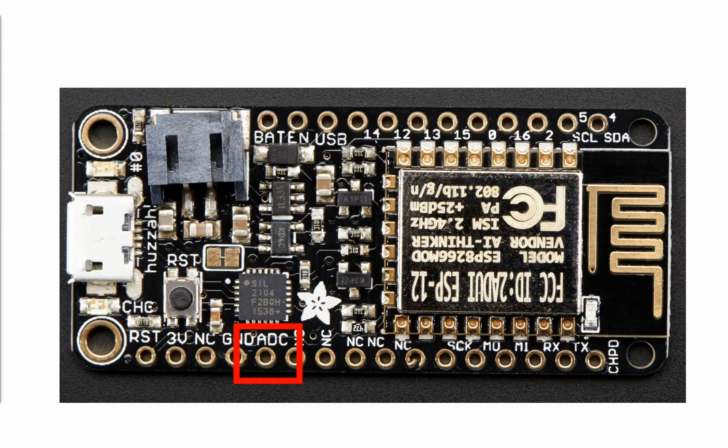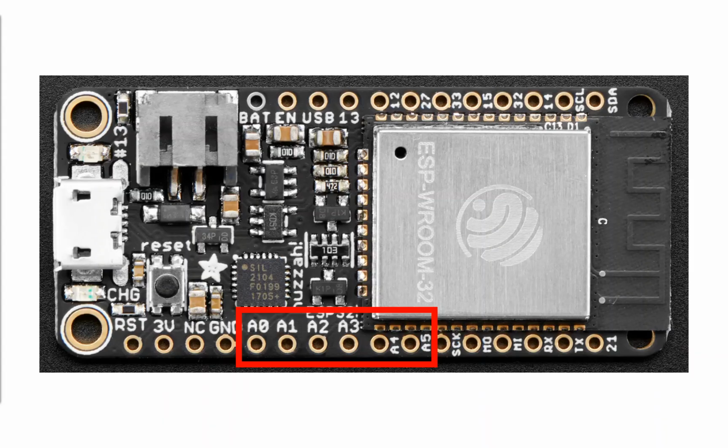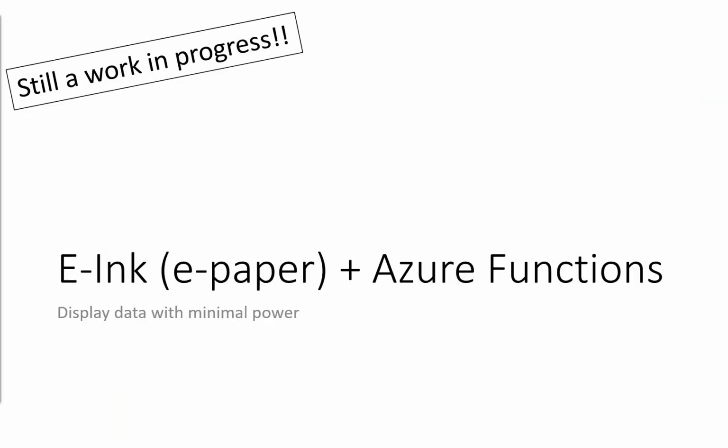So today I've been talking about the ESP8266. The ESP8266 was the first iteration in a number of boards made by a company called Espressif, and it only has one analog to digital converter. Here's its successor, the ESP32. There are 6 analog sensors on there, so you can have a nice set of 6 plant sensors set up on one board. They are marginally more expensive, between 50p and £1. However, they are the newer iteration of the board. The code isn't as stable yet, but give it another couple of months, and I would say develop on the ESP32 by default.